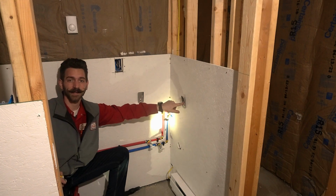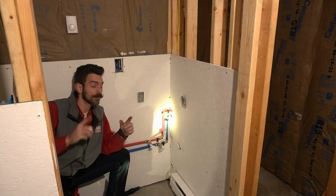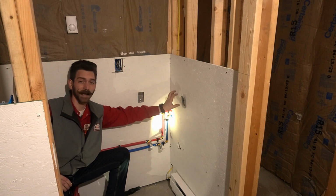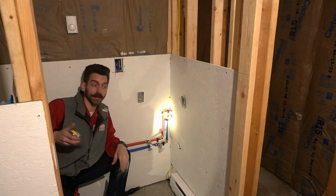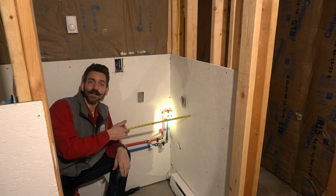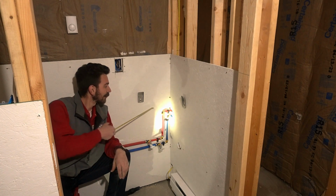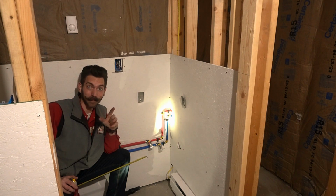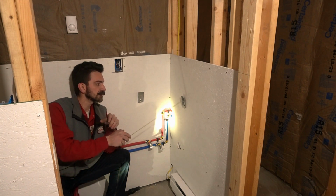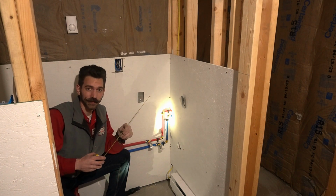I use big old fat head bolts because they sent me one big old lag bolt, but it was like this long, which is, I don't need it that long. I got backer board behind this, also big deal. Make sure when you're hanging one of these, you don't just hang it even to OSB. We've got 2x6s mounted on the back side in here. So make sure you got something solid to mount to. Anyways, once you've got these clips in place and leveled, you're ready to come in and set your sink.